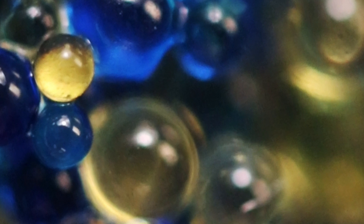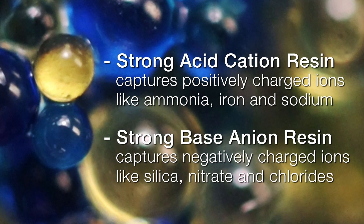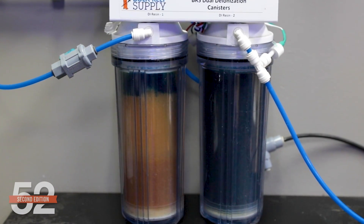By far the most common cause of rapidly depleting DI resin is carbon dioxide in your water, or something else consuming the anion resin. In a color-changing mixed bed resin, the cation resin is largely brown, and most of the anion resin beads contain a blue dye — various shades of blue to clear depending on how much dye they absorbed. When the anion resin is depleted, the blue dye turns clear, making the resin appear golden brown. If carbon dioxide gas is in your water, that blue change will happen really fast — anion resin depleted — but the cation resin beads might have as much as 90% of their life remaining. This ends up being wasteful, costly, and time consuming.